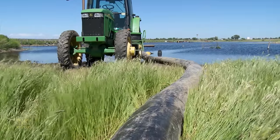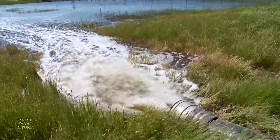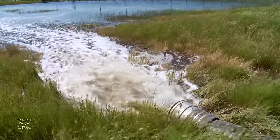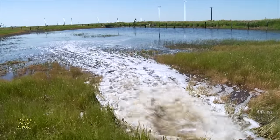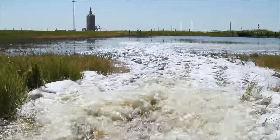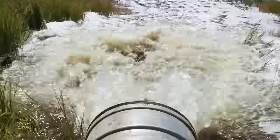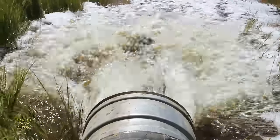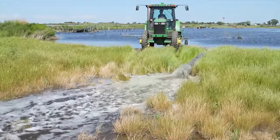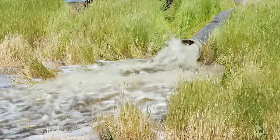The Dynaflow unit is designed to run off a 1,000 RPM power takeoff and only requires about 20 horsepower. Right now they're working with a single 50-foot hose, but Rosendahl says they have successfully pumped up to 1,500 feet with this system. They use a 12-inch hose off the discharge, and once 50 feet from the pump, reduce it down to 10-inch aluminum pipe. The gallon range drops with 10-inch pipe, but it's probably still in the 2,000 to 2,200 gallon range, providing there's not a lot of elevation in that 1,500 feet.